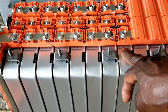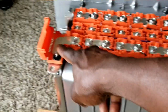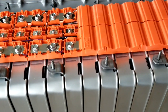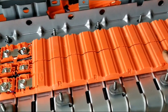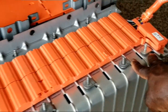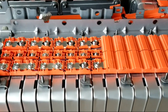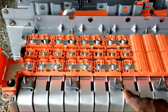From that termination point there'll be a positive or a negative — whichever side, the opposite direction is on the other side. I'll do the same thing for the other batteries: one, two, three, four, five, six, seven, eight — and that's the rest of the batteries all the way back there. That gives me my 48 volt configuration. If I want to do a 14s I can just take it to fourteen modules.